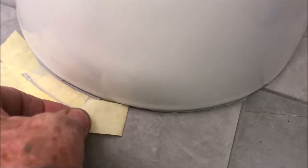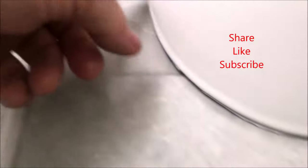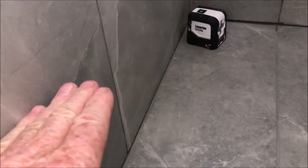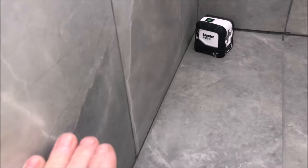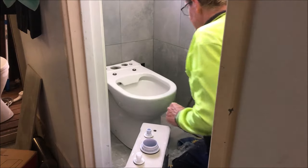Just pulling the tape off — that's why it was under there, because I wanted the silicon not protruding out but tucked right under, so when I put white silicon on there it'll dress and detail the finish. I didn't want silicon residue on the tile — once you get silicon on tiles, even with a blade you'll still have residue. Now that's ready to seal. I'll screw the cap back on top. Once this silicon's dry, this isn't moving — silicon is very strong. Think of a six-foot fish tank butt-jointed with silicon under enormous pressure — if it can hold that, it can hold a toilet with a hundred-kilo person sitting on it.